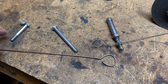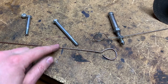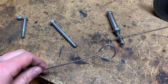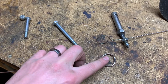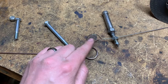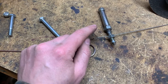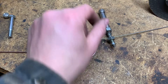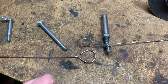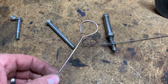I just want to show some of the failures. This is the first bolt that I broke off the nut. This is the filler rod I first used — it's got that flat spot where they mark the filler rod; you don't want that. So I did it again with a smaller stainless piece of filler rod that seemed to work better, and I also cut the weld off of this to give a little bit more spinning action.